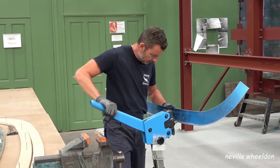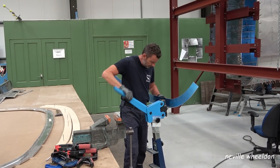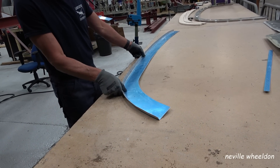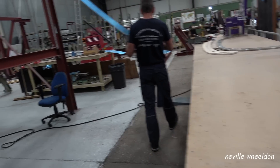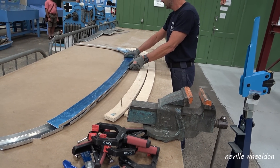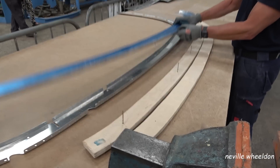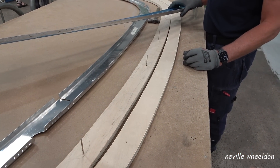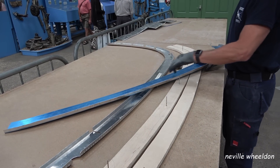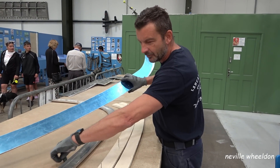Dave is manufacturing the inner former to fit in the outside of the door frame. This is to give it extra strength. These are easier — a lot easier to turn around really quickly. It's not quite the shape yet. From there down to there, then it's got the shape. How many sets of rivets will you put in to secure both together? Probably just a couple of rows in between just to hold it together. You've got loads of rivets going through there, and obviously when that's done they're going through there as well. It's going to hold it in position.